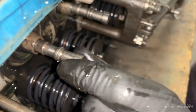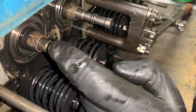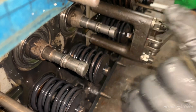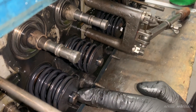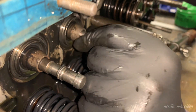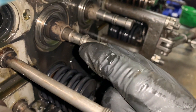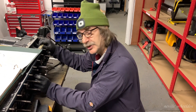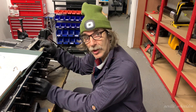As Bradley mentioned earlier, we've now fitted the valves. As you can see, there is a small snap ring located on a groove on this valve — for the purpose of this video, we have not fitted it to this valve here. Why is it there? It's there to prevent the valve from falling into the cylinder in the event that the valve springs or the collets fail. If a valve spring breaks, you lose the tension on the collets, and they tend to come out, which means the valve would fall into the cylinder, get caught up with the piston — bang — you've now got a catastrophic failure in your engine. With the small circlip fitted, it prevents the valve from falling into the engine. So you would now have an 11-cylinder Merlin, but it's better to have an 11-cylinder Merlin than no Merlin at all, because if that valve were to fall right into the cylinder it would cause a catastrophic failure that would likely stop the engine dead.